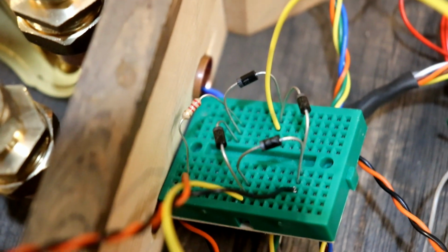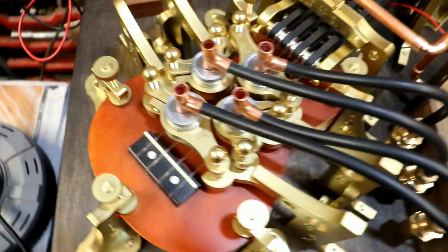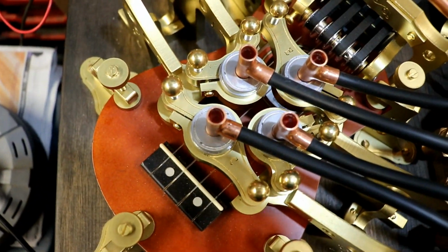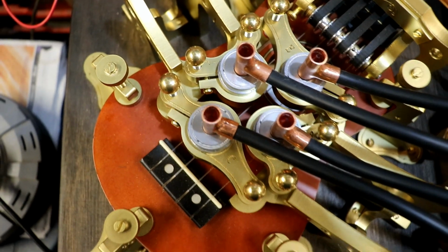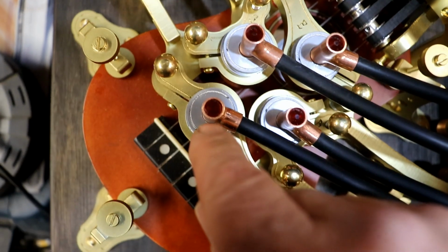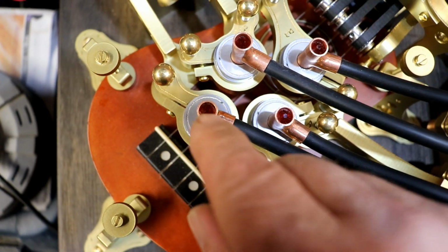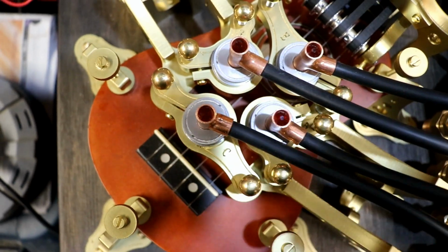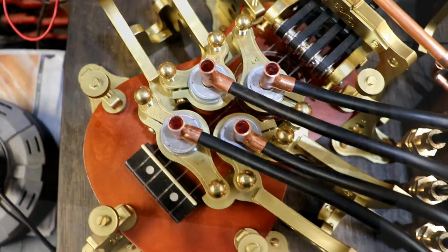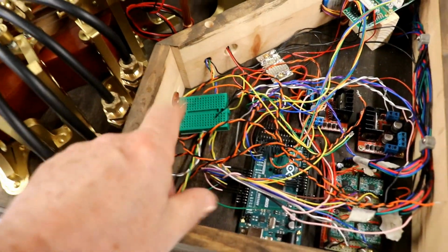Well, I've ended up replacing it with a 2K2, 2200 ohm resistor, which is far higher than necessary, but because I'm not illuminating anything with it, that's much nicer now. You can see the nice flower effect of that gem, and it's not glaringly bright, so I'm happy with that. Now to get on with these bridge rectifiers.